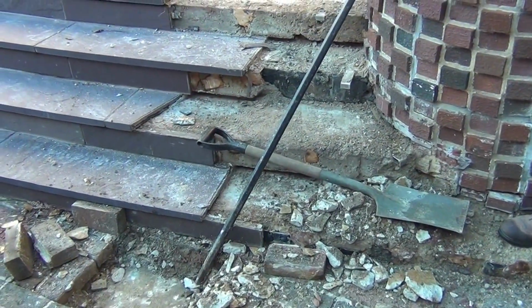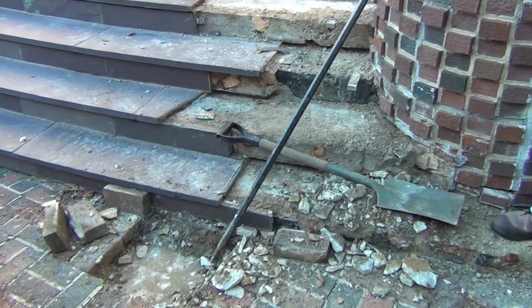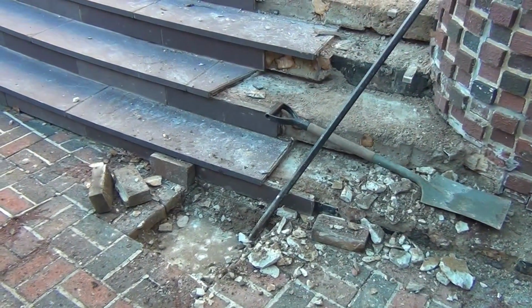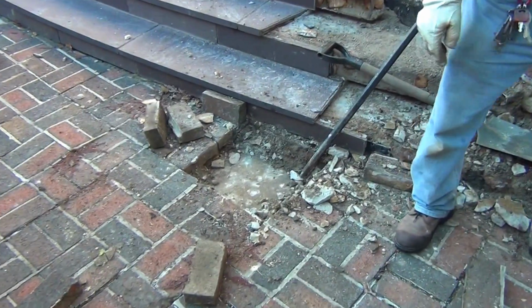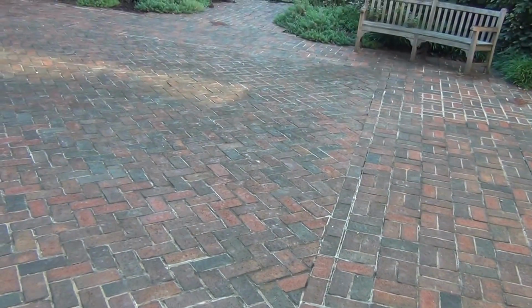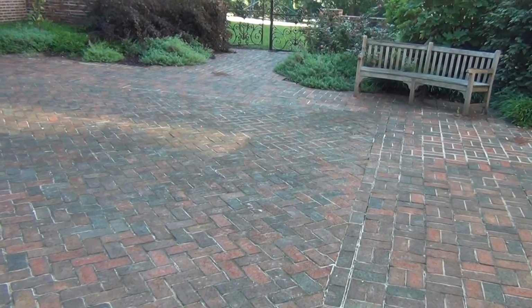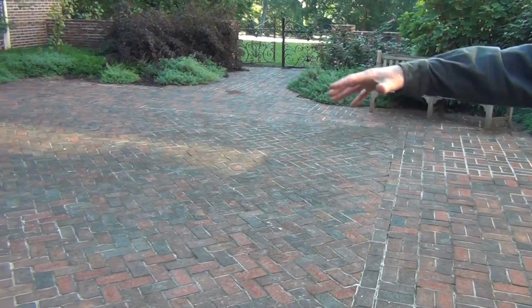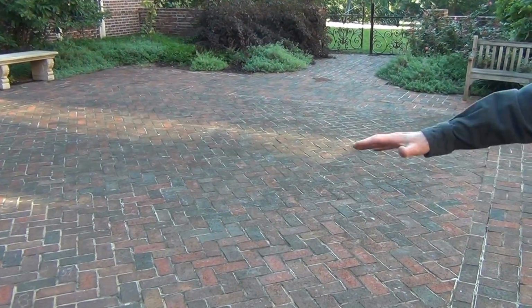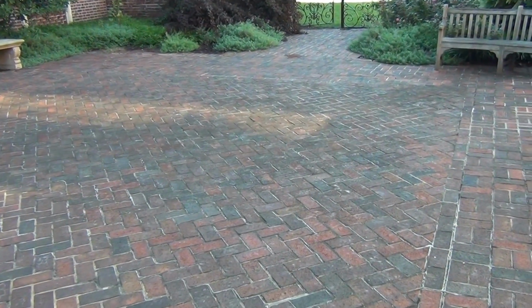So if your high point is the perimeter, you might still need to raise this over here and go to here, and then you just cut the concrete and put your drain to daylight. We could saw cut the concrete and put drains in. Probably in the middle you'd need to get rid of that concrete and put in a catch basin and go from there.